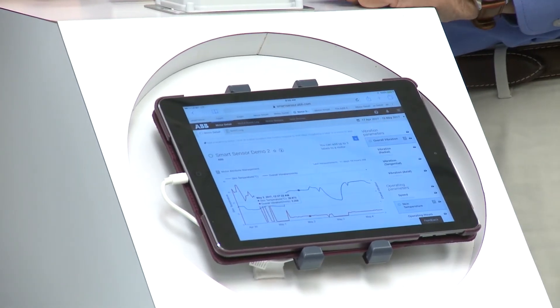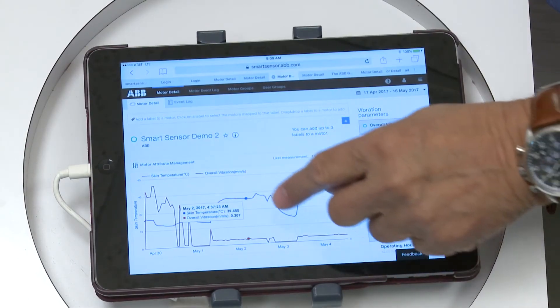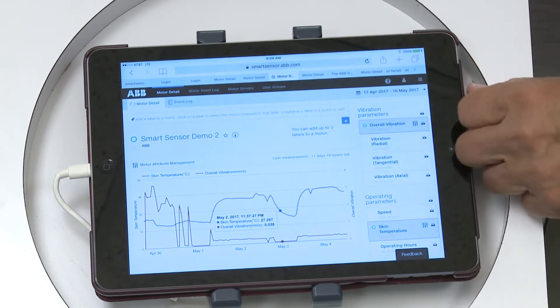The portal ties all this together. This information — in this case temperature and vibration — is shown on screen. You can see the vibration in various axes, and there's even the ability to detect speed and other key parameters and loading on the motor. It kind of looks like the stock market — you can click on a section and see a time and date stamp with actual values. It gives you the overall condition of the motor on the app and then detailed information, so you can plot different points and see where your motor ran hot or wasn't performing well — whether it's based on loading, outdoor temperature, or a clogged fan causing overheating. It helps you identify how your process is doing.